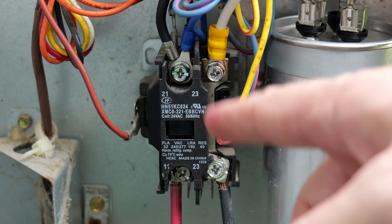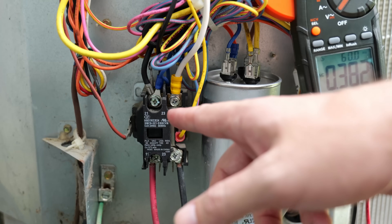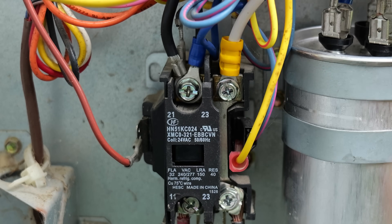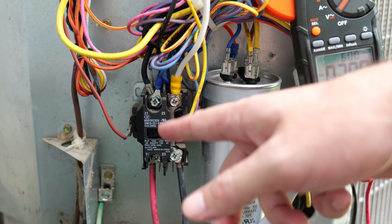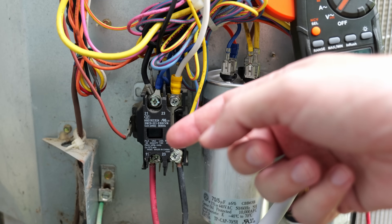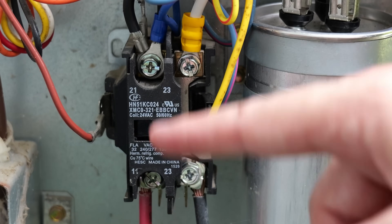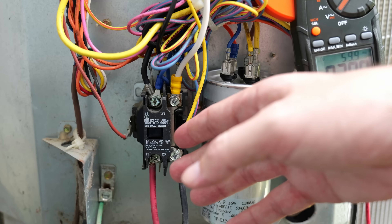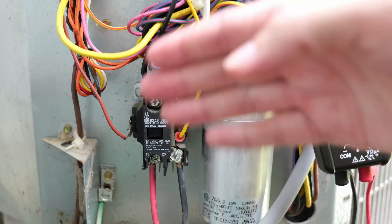If your contactor was bad, on a single pole you would not be getting good contact. A double pole would have plungers on both sides, but on a single pole like this, a bad contactor means you would not be getting voltage on the top left leg. It's not always just worn contacts — a lot of contactors are open where you can see inside, and bugs, especially ants, are notorious for working their way into the contacts and acting as an insulator, so power doesn't get passed to the top. The contacts themselves can also become corroded and not conduct electricity well.